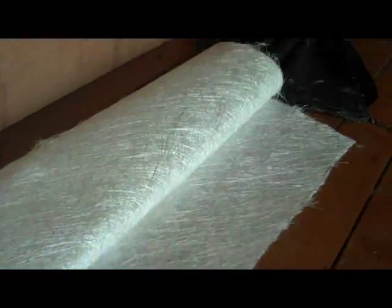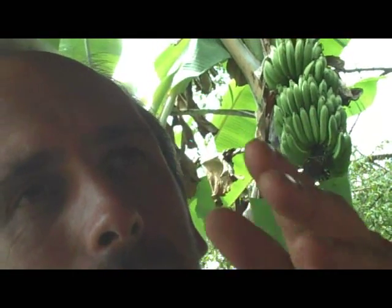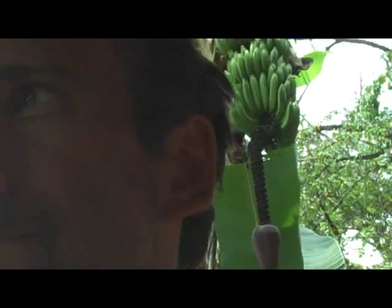Alright, I'm trying to figure out how to arrange the fiberglass on this thing. I could take a big sheet and just wrap it around the whole thing, but I'm not going to be able to get resin all the way around. I'm afraid that if I put a sheet of fiberglass on and only resin part way and then come back to it later, where it stops it's going to be a rough, extra lumpy part. So I think whatever cloth I put on, I have to resin the whole thing — because resin overlapping over the cloth will smooth it out, but cloth overlapping the resin will make a rough spot.